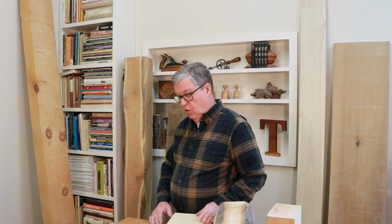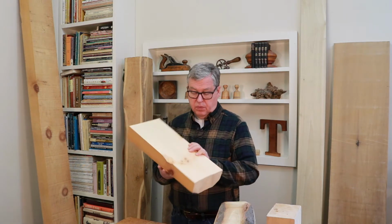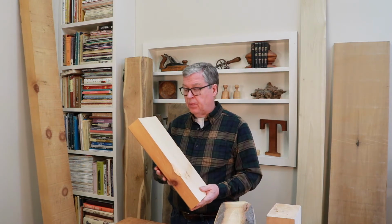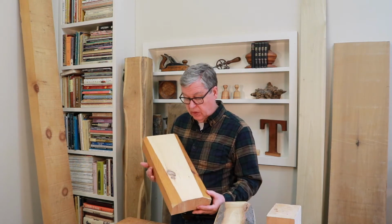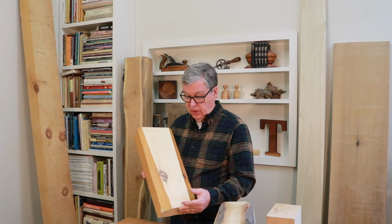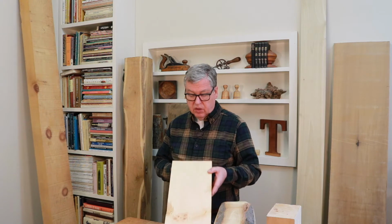My number 4 is white pine, and white pine is a little softer than yellow poplar, but it carves very well. And the only problem I probably have with white pine is some of the knots that you get in there. So in between the knots, you got some clean wood. Even the knots aren't too hard to carve if it fits into your motif. If, like, say, you're carving a mantle front or something like that, and you want those knotty looks. But the knots will probably take the edge off your tool. You have to touch them up, but they're not too difficult to work with.